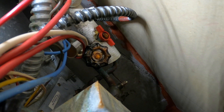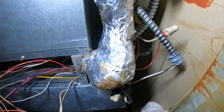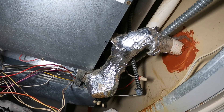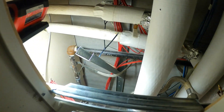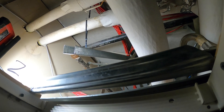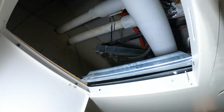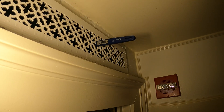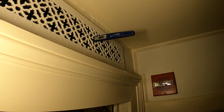I wonder what's going on with the chiller. It's tight in there, but the two valves that are there are open — that's not the reason for this issue. I wonder if there are more valves in the hallway that someone added. Here's the access panel outside of the room — and look at that: before I even went to check the chiller, this valve is closed. Let's open that — and this one is closed too. They were probably trying to troubleshoot something and that was their fix. Now that's all open.